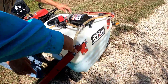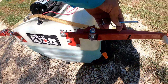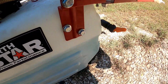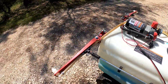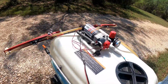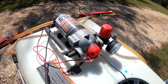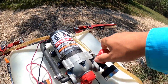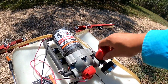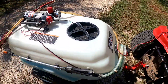My dad's working on extending out the boom right now. This is kind of hard to do with one hand. What you want to do is make sure your valves are open on both sides. You close this one off to force the water down into the wand, the hand sprayer, and you open it up to push the application to the boom. So we've got it on full — probably go half. All right, I think we're good to go. We've got everything hooked up to the battery, got the booms out, everything's ready to go.